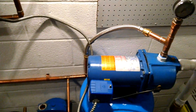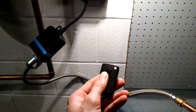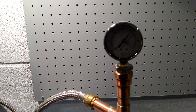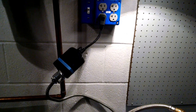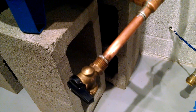I hooked up my well pump onto a remote control outlet, which I can control from here. When you kick it on, you can see the pressure reading — it's about 39 right now. You're just kicking it on for a minute to get some water in these tanks and expand the water bladder. Then you can drain the water off using the drain valve on your tank — open that up and drain all the pressure, air bubbles, and sediment out.